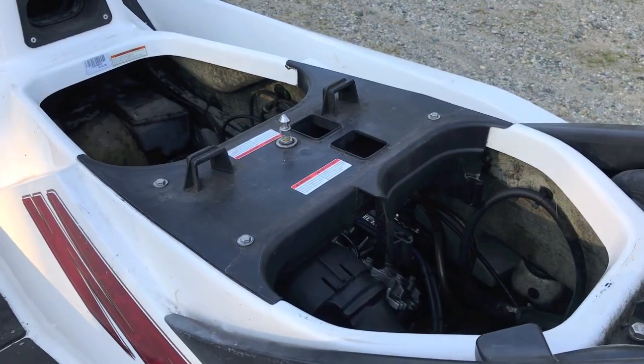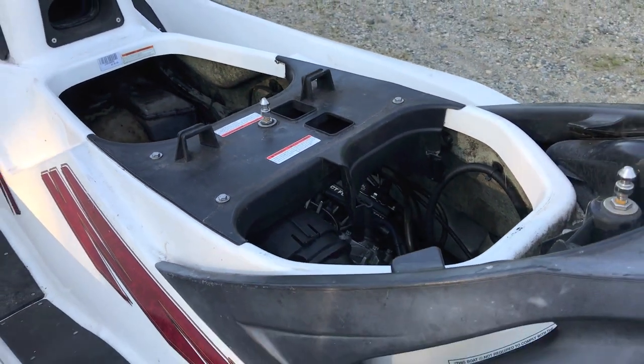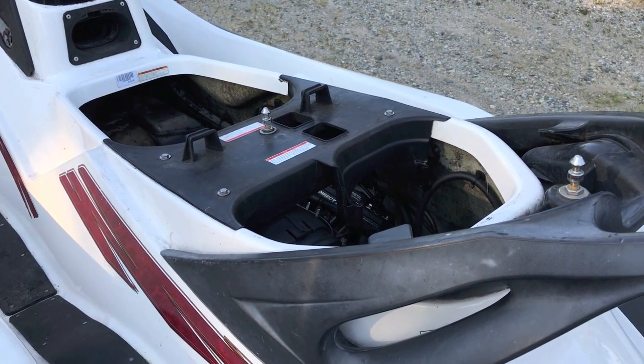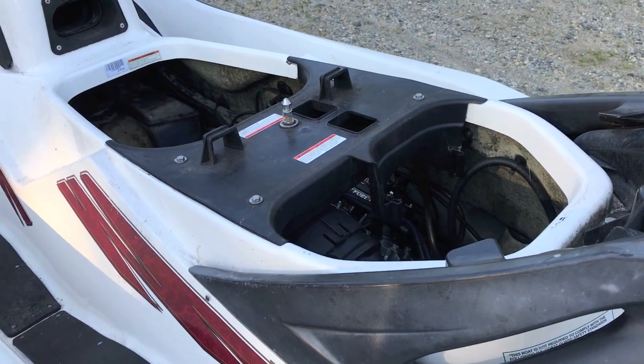From here we want to take off both front and rear seats. Seats are removed. Now we can see inside the hull and verify that there are no leaks while the water is entering the system and the engine is running. Something very important that needs to be pointed out: for proper cooling of the engine, you have that drain line that water spits out at the tail end of the cooling system through the engine.